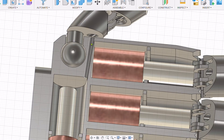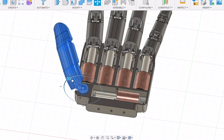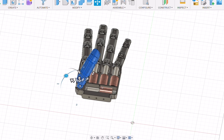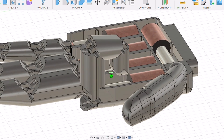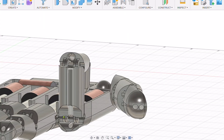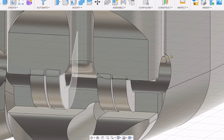As for the thumb, it's mounted on a ball and socket. The idea is roughly the same as the fingers — when the string is pulled, it should rotate and pull the thumb over at the same time as closing it in. How well that will work in practice I'm not sure, but we're going to find out. The fingers should close up pretty tightly, depending on how much throw I can get out of these coils and rods. To secure each joint I'll slide some 4mm bar through and try to get it moving as freely as possible. You can also see at this angle where the elastic will run through the knuckle, though I'm not sure where I'll attach it yet.